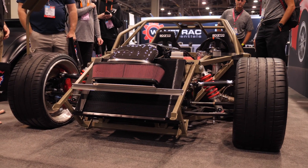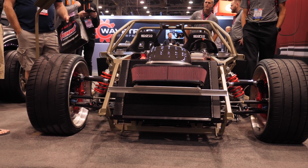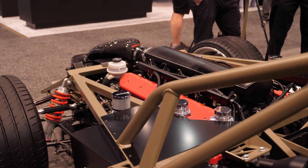In terms of bank angle on the V12, we've retained the factory LS 90-degree bank angle for two or three reasons. First, compatibility. Second, a wide bank angle with a V12 is really good for getting a nice angle on the intake runners — a lot of the power is made before the heads in that intake. Third, keeping a nice low centre of gravity. With the Factory 5 build, a 60-degree V12 just wouldn't fit — they've kept that low centre of gravity, same reason Corvettes have been so successful. Chevrolet gets a lot of flak for sticking with a cam-in-block, but there are a lot of benefits to a 90-degree cam-in-block.